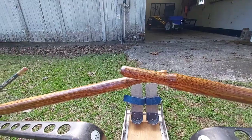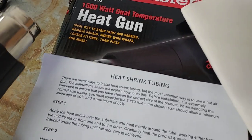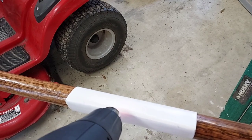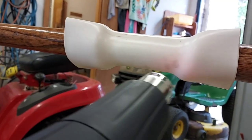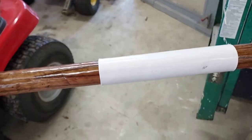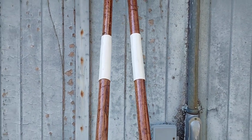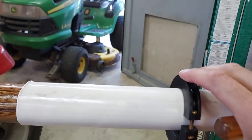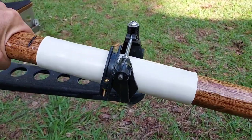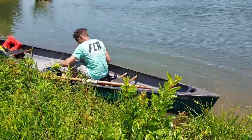That's how they look on the rowing seat. Now if you look here, these white sleeves are shrink sleeves — you use a heat gun to shrink them tight to the oar shaft. I got these again from that same website, adirondackrowing.com — they've got just about everything. Placement is important because you want to have the oar locks on the sleeves, and you can have where the handles of the oars cross over a little bit. That black item there is just a collar — it keeps the oar from sliding out.